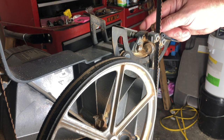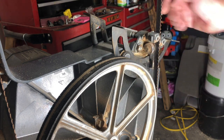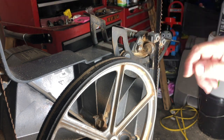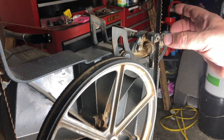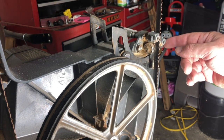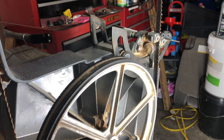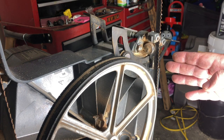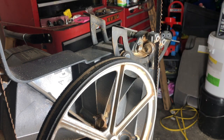You can see there is adjustment left and right by loosening the bolt here — the nut is captured. By loosening the bolt, I can move this entire assembly left and right to get my blade aligned with the center of the thrust bearing. Once positioned, I can bring my guide blocks in and they will also be centered on that casting.